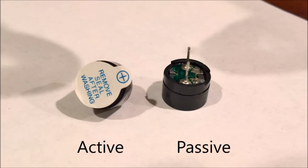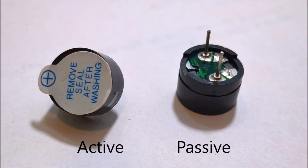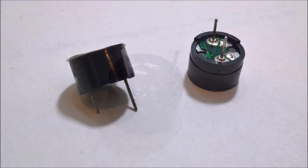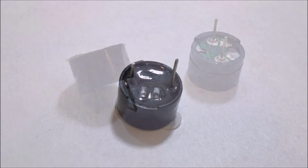First we'll need to briefly talk about buzzers in your kit. There are two piezoelectric buzzers that look pretty similar, one that has a sticker on it and the other without. You'll also notice that one with the sticker is sealed around the pins with some kind of black epoxy. I think that the tutorial calls this black tape. And the positive pin is longer.